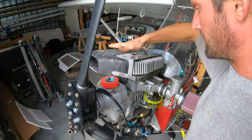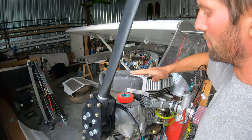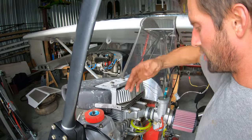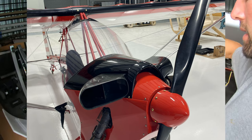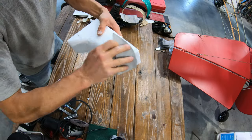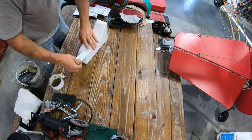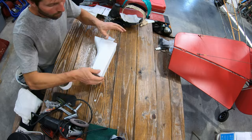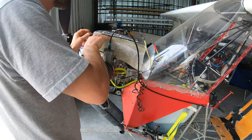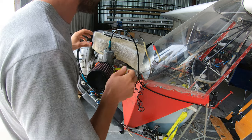This had a top fairing which would basically guide the air through the top of the cylinders and then out. It is missing — I've tried to locate it. So I have to make my own. I'm just going to cover this with some plastic and then put a piece of foam here, shape it so it has the same inlet as outlet. Hopefully that works. The fairing goes through and cools the engine — and if you guys remember, I was having cooling problems on the last flight when I almost went into those light beacon things. It was running pretty hot.